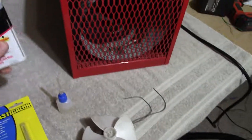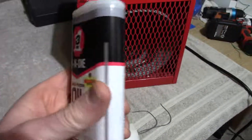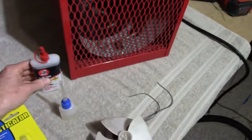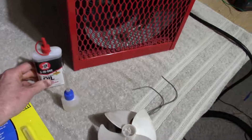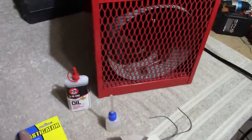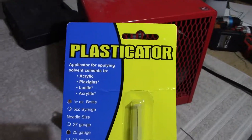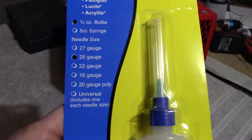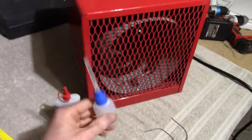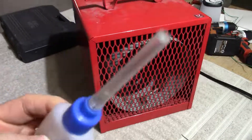The type of oil I use is 3-in-1. You can also use the zoom spout. You don't want to use grease on these motors — you want to use oil. To apply the oil I like to use these little bottles that have a syringe. Normally they're used for gluing plastic together; you put the solvent in there and they're from Craftix — I call it a plasticator. It has a 25 gauge needle on it, and I like that because it's precision. It applies the number of drops you want to put in and it doesn't get all over.